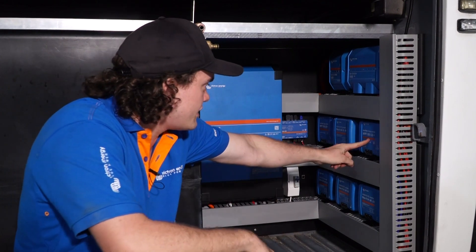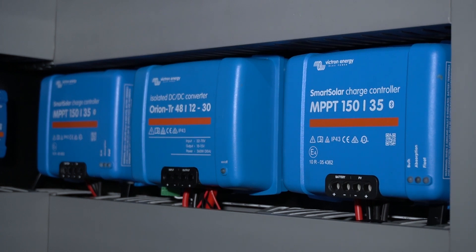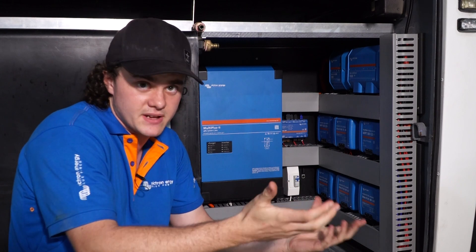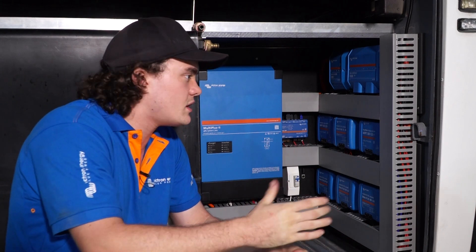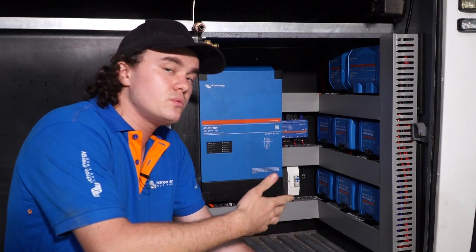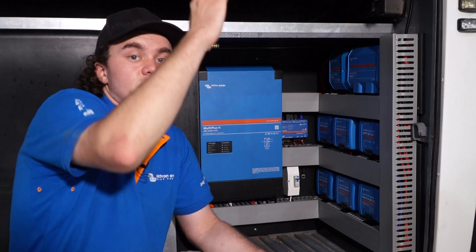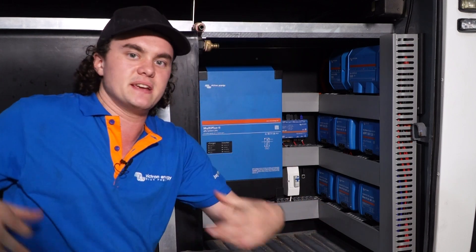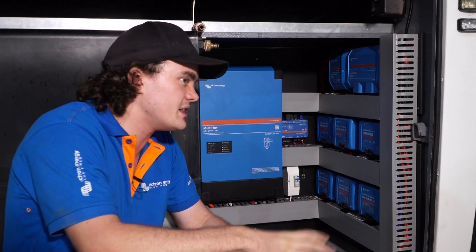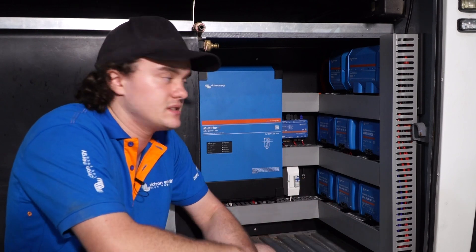We've had Vince run the five panels in series through this solar controller, and four panels in series through this solar controller. We're really taking advantage of that series configuration to get the voltage nice and high — to save on voltage drop as mentioned earlier, but also having higher voltage means the solar starts up earlier in the morning and finishes later in the afternoon. We're not too worried about shading that would normally be a problem with series connections, because the bus is so high and the big open areas up there really lend themselves to open sun — unlike a typical caravan with aerials and air cons on the roof.